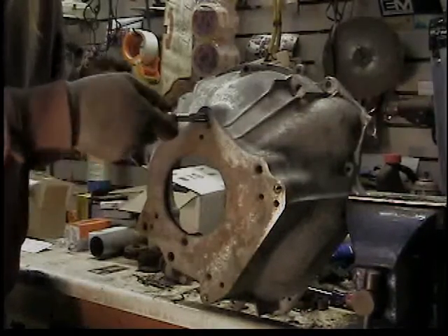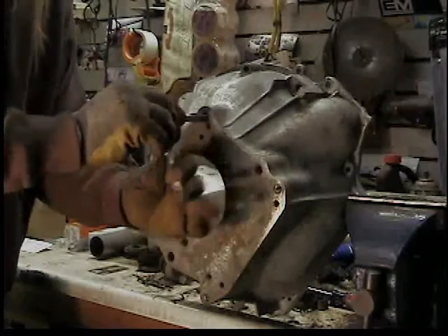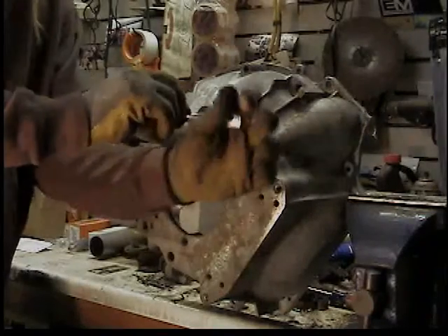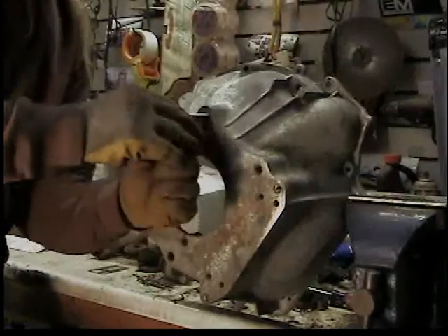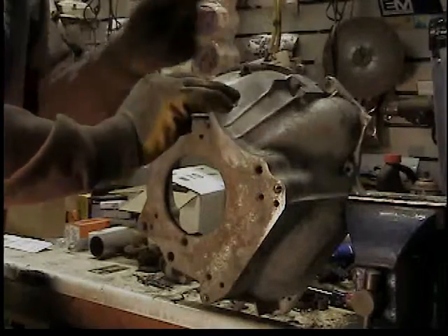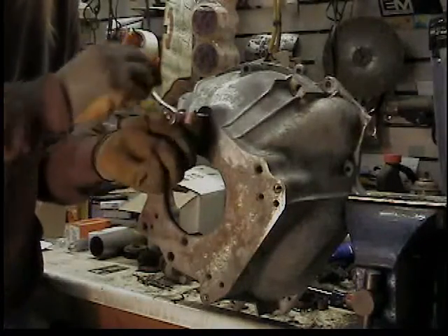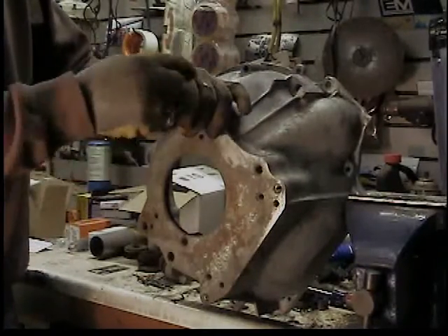Here I'm tapping. If you've ever used a tap, you just screw them in, and if they get a little tight you back up. I'm using a ratchet — I just reverse the ratchet, turn back about a half turn to clean the tap, then tighten in until it gets tight, back up a quarter turn. This is just standard tapping procedure. Eventually it gets through — I run the tap all the way through so I get nice straight threads all the way in.